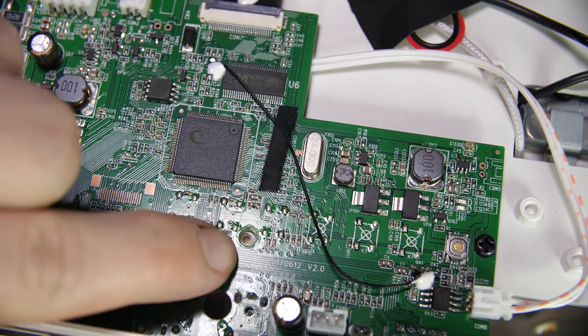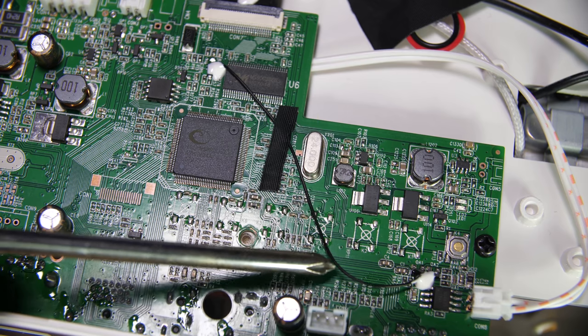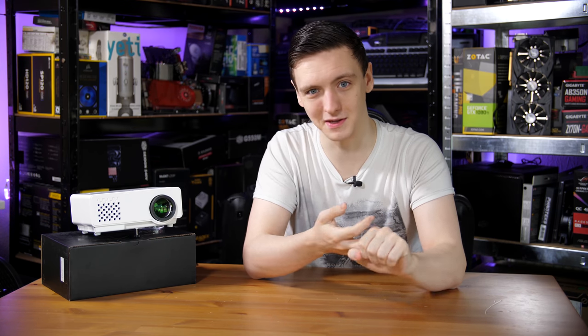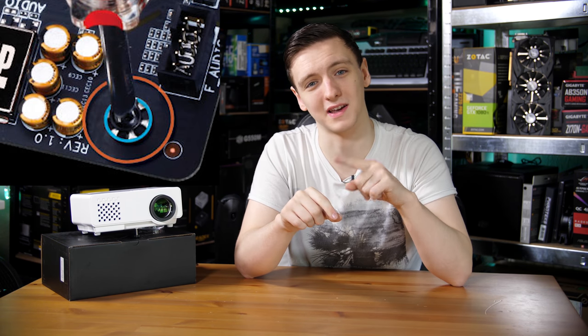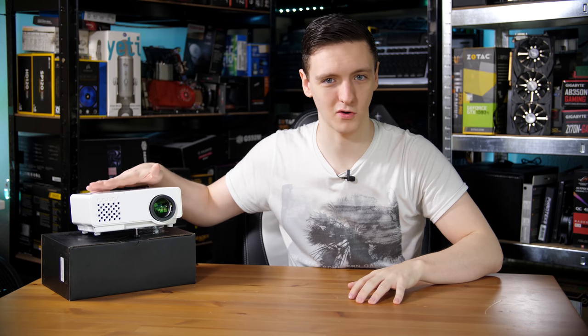They also use self-tapping screws into the plastic, and while these screws aren't grounded, the central screw actually cuts into the circuit board, exposing the copper and cutting a trace — if the screw were any wider it would have destroyed that trace entirely. It seems to be functioning fine, but the screws are very badly designed in that they're cutting into the PCB and potentially destroying traces. Standard practice is to leave significant clearance around mounting holes — on a standard ATX motherboard, mounting holes have grounding pads and at least 3mm of isolation all around, so compared to that, this board is pretty terrible.